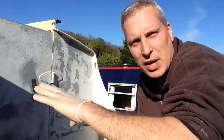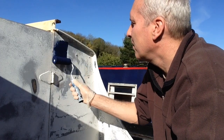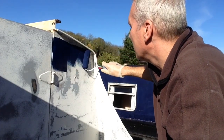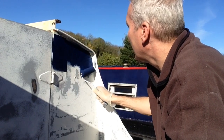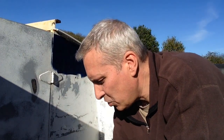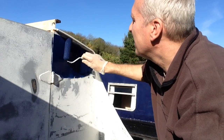Sometimes it's okay to go a bit more if it's a nice straight plain bit of metalwork. But because we've got little bits dotted around, I'm going to reduce the size. So with a loaded roller I'll just start rolling on, working the paint on, going all the way to the edge as much as I can, making sure it covers nicely. When you start painting, your roller will be empty — it will take quite a bit of paint to get it loaded up properly and then it will start working a lot better. You'll hear it really hissing, and that hissing noise as it's rolling tells you that you've got enough paint on.